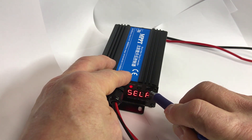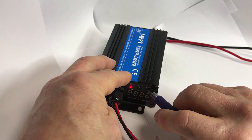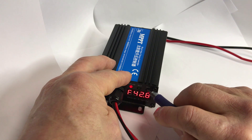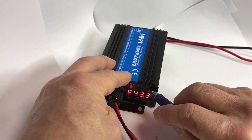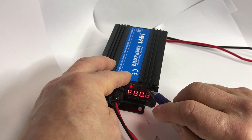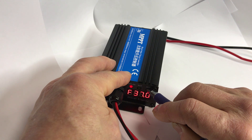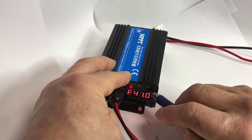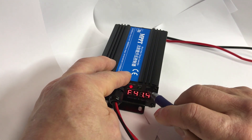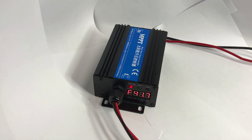You hold it again, then it will show you the voltage that it's going to set it to, and you can keep holding that down. Every time you click it, it goes up one, and if you hold it down long enough, it starts going fast. We want 41.7 or so. It's going to rotate all the way around — the highest you can go is about 80 something — and now it's wrapped around and going back up: 30, 41. We'll stop it, and then go to 41.7. You just let it sit for a minute and it will accept that voltage.